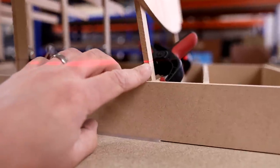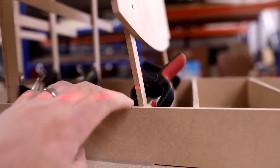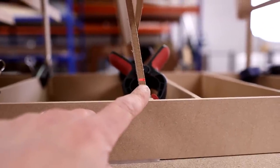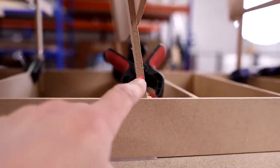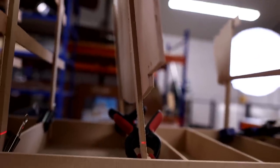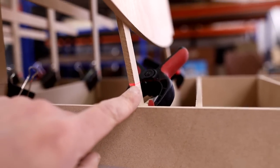We actually, if we were to square that around, we would end up with a line that's pointing downwards now that the frame is leaning forwards. And what that would do is create some confusion because we'd have different heights. So the height of the frame would differ based on which part of that line you put through the laser. So what you want to do when you're setting the height of this frame is to reference the line that is on the mating face